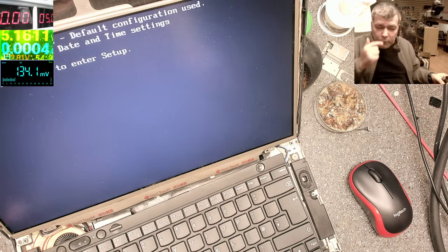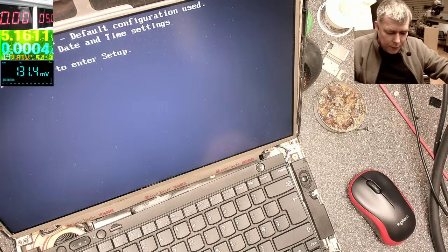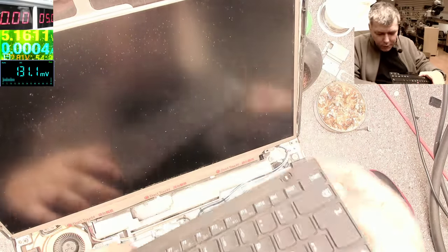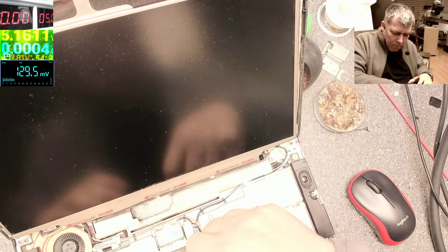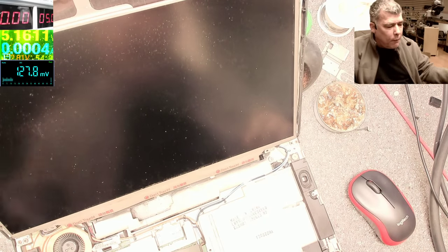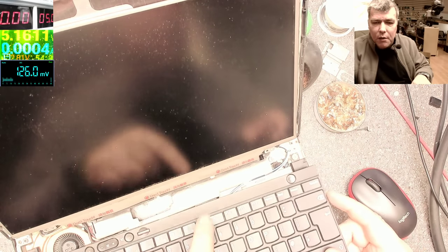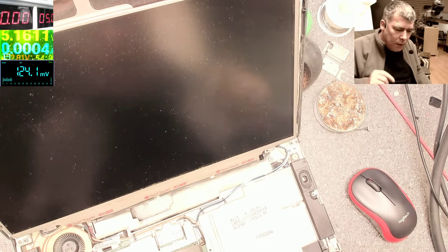Okay, this is just for my info. Unplug the charger. So it's possible that the fault is because of the keyboard. It can be like the backlight, the dim button is pressed, and that's the reason why the Super IO is not outputting the signal.